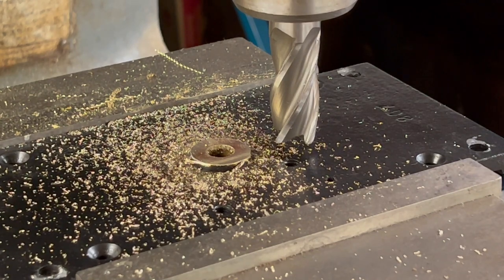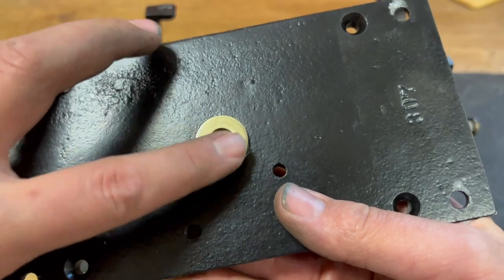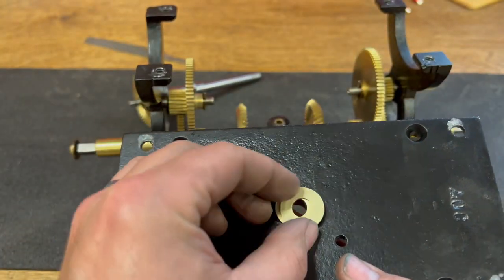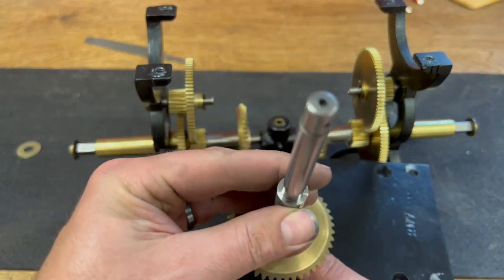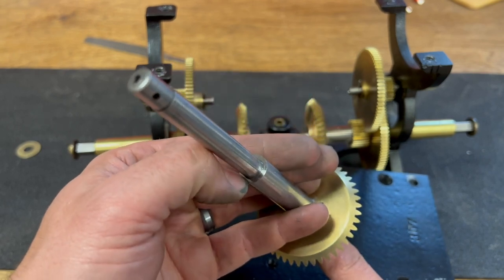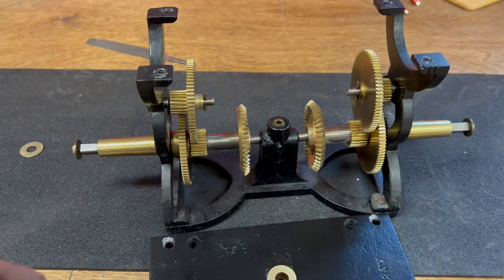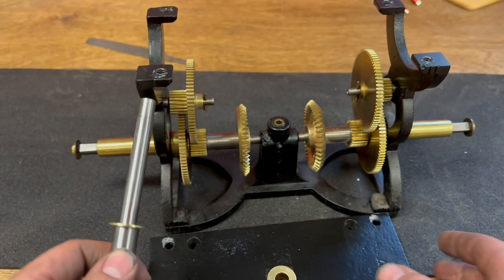Now we have a new surface — the Bridgeport and a little bit of polishing gave us a nice new surface here, and we have our custom washer which fits that pretty nicely. The other area of wear was the bottom of the shaft itself — this was actually fairly chewed up, so I polished that again, cut a little bit of material off to give it a good shoulder. We'll put it together and see how much end shake we have with our custom washer.